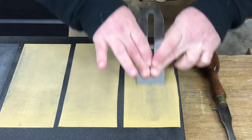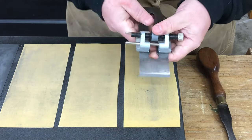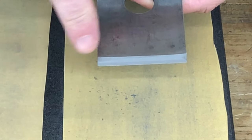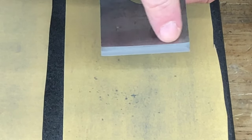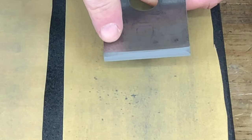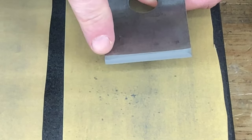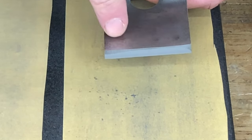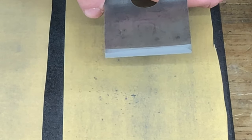I think these last few strokes should probably do it. Now you can see the bevel is straight side to side, all the way across, and extends completely across the face of the iron. You might notice we haven't honed the corners yet — that's because this blade was probably ground closer to 20 degrees before, so we're increasing that bevel angle slightly. What I'm most concerned with is making sure I have an even scratch pattern across the entire surface and that the edge is nice and straight.